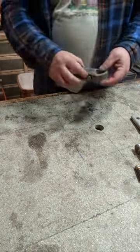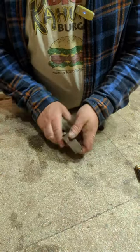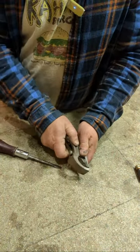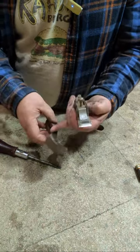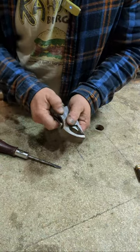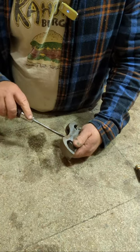Right, over here we have this little bullnose plane. It's a little rebate plane, but it's also a bullnose, so you can go fairly close. You can also make it into a chisel plane by taking the screw out here and removing that part, and then you can use it right into the corners in the rebate. It needs some TLC because it's got damp and will start to corrode a little bit, which is annoying. You can also adjust the mouth by sliding this backwards and forwards. Useful tool though. Back into its space. Everything needs to have a place, you see.